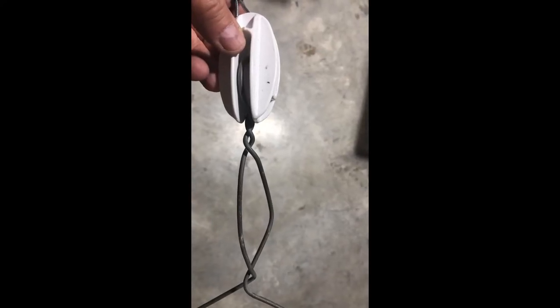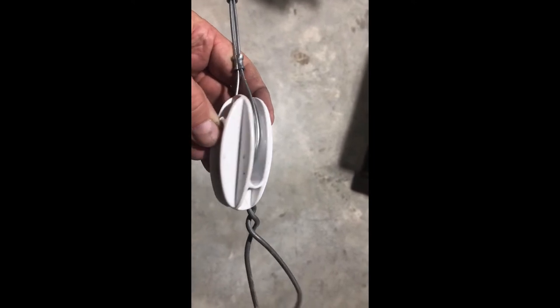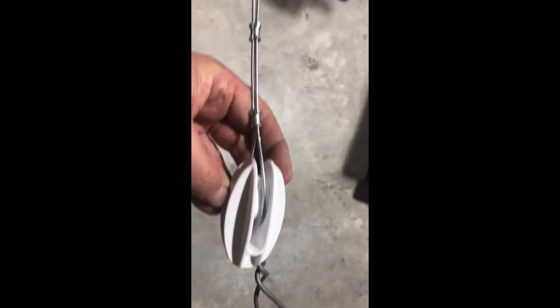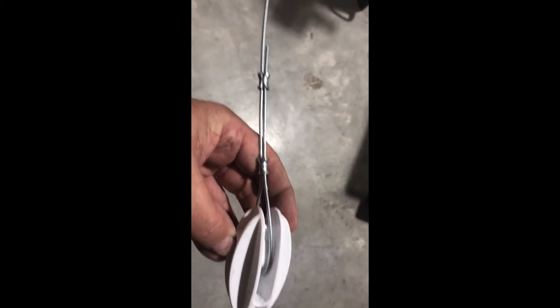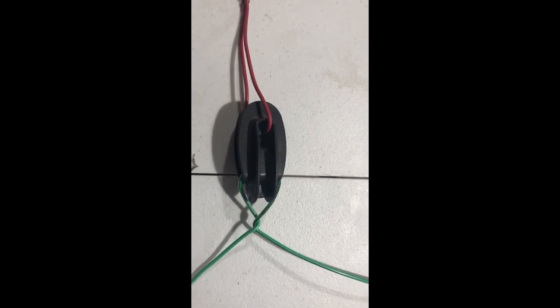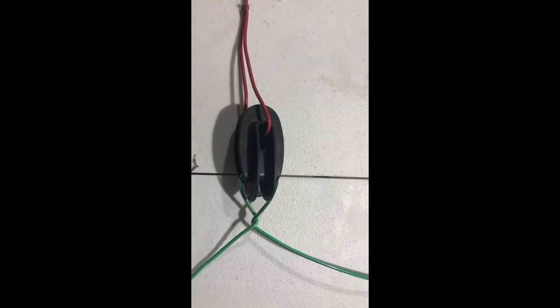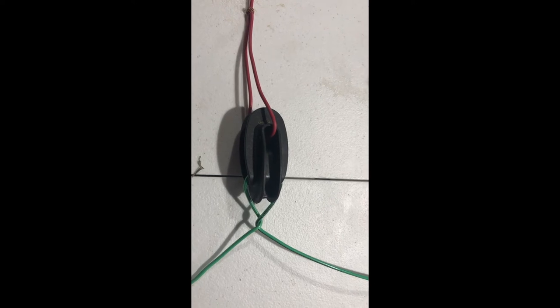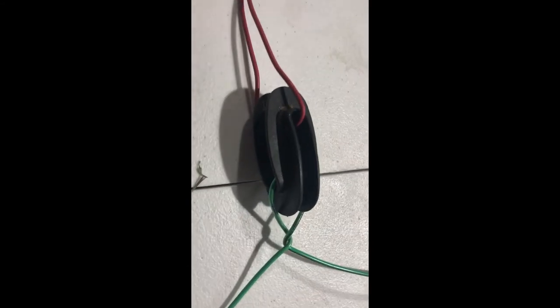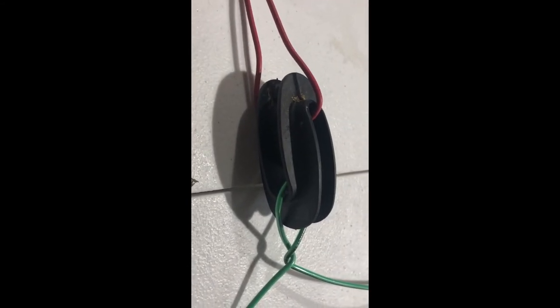Here we are at an end insulator. If you look at this picture, you can see the right end would be tied to the post — it comes out to the insulator. Note that the wires overlap: what ties it onto the post overlaps what goes out to the fence. We put two crimps on this and you can see that's going to hold it relatively tight. Here we've tied a bullnose insulator on incorrectly — the green wire does not overlap the red wire, which makes this very weak. The right-hand side is where you'd tie it to the post; the red side is the hot wire. But it does not cross over, so it's very, very weak and that is not the way to do it.